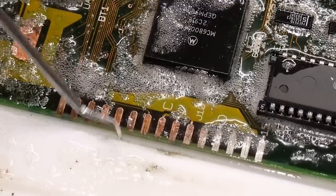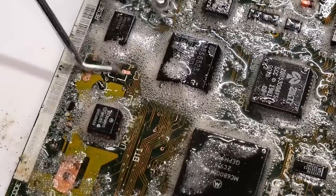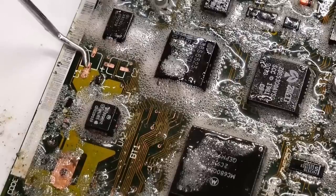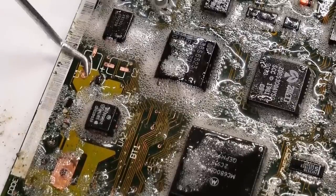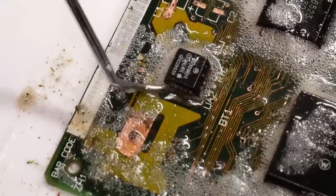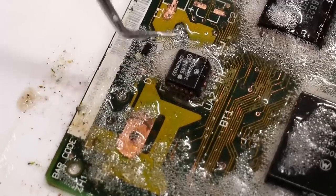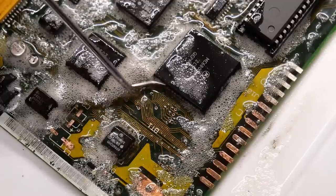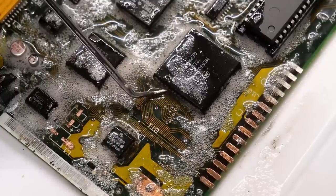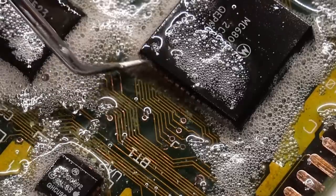There was a lot of green oxidization on this copper, and the WD-40 seems to have made it much easier to get rid of that oxidization — now we're seeing the bare copper underneath. The same goes for this area over here where a couple of electrolytic capacitors were that just simply disappeared. You'll notice now you're just seeing the bare copper; a lot of that corrosion and salts has been washed away. The solder mask has been removed in places and there's the copper under there, which actually looks all right for the most part. It seems like a lot of the fuzz that was around the IC legs has also been removed, and we're left with the legs of these ICs exposed as a copper color. This is the processor — there was a lot of fuzz and corrosion, but it looks like we're now seeing the actual copper legs, which appear to be plated in some kind of a tin coating that the battery corrosion removed.